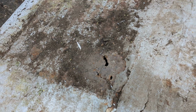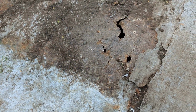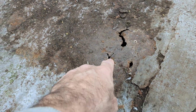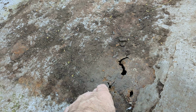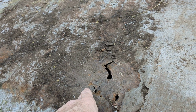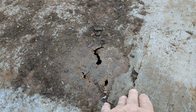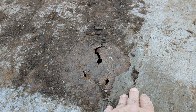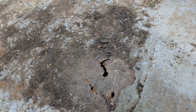And here's the situation. This roof that's sitting over there, the 2x4s and metal, was on top of this for like a snow roof. And so I think what happened is there was some mice that got into here and caused the corrosion that resulted in this small area here. Galvanized though it was, basically rotting. I've seen it exactly twice in about 25 years I've been doing this, where it just disintegrates like this. And both times it had a roof over the top of it, and I think both times was probably from whatever's in the urine of the mice that was making a home on top of it. So that's why you want to keep mice and other vermin off the top of your roofs.